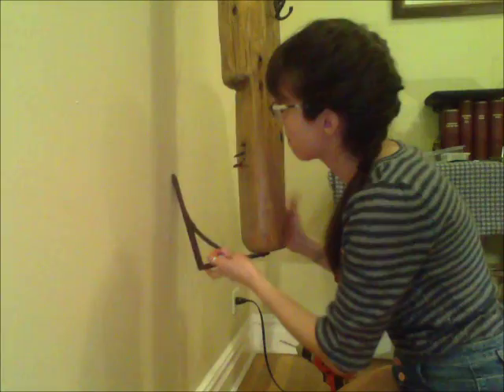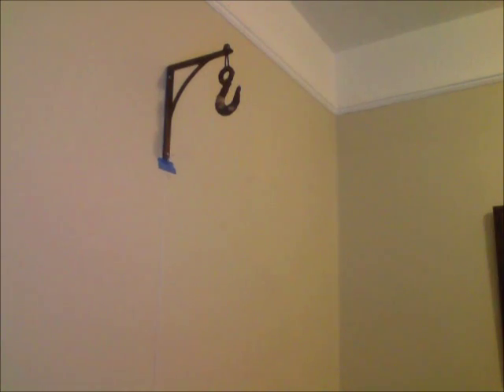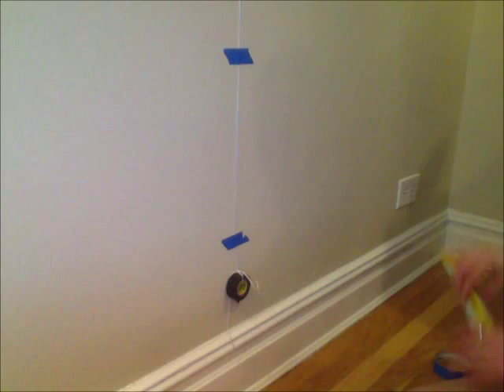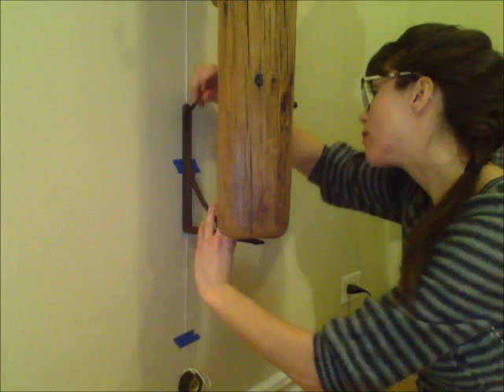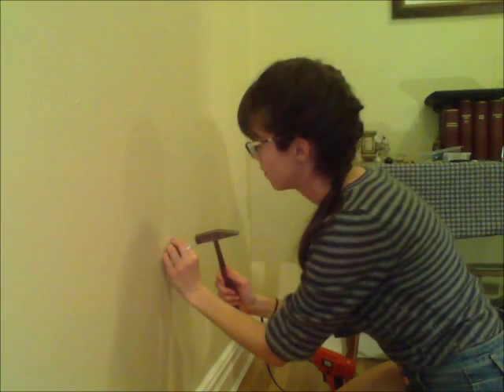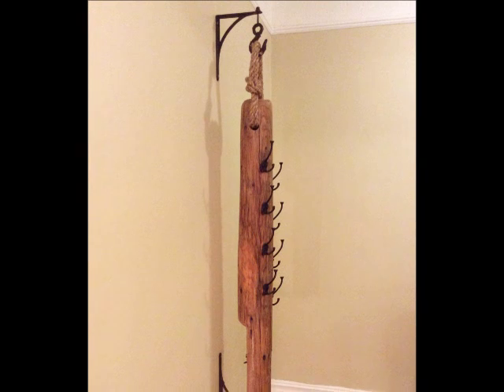Now I'm going to secure the bottom of the coat rack to the wall with the second bracket, since I don't want it to swing free and possibly damage my wall. To get the bottom bracket aligned with the top one, tape one end of a piece of string to the center line of the top bracket and tie a roll of tape to the other end to weigh it down and keep the string taut — this should make a straight line down from the top bracket. Tape the bottom of the string to the wall and ensure it's straight up and down with the level. Line up the bottom bracket to the center of the string and gently align it to the bottom of the coat rack. Mark where to screw the bracket into the post and where to install it in the wall, pre-drill holes, then install the bottom bracket and attach it to the post. And there you have a finished coat rack made out of repurposed wood that's far more original and costs a lot less than a store-bought one.